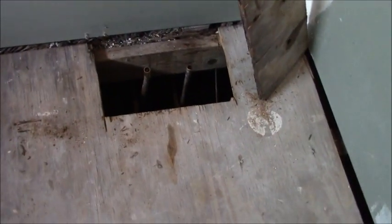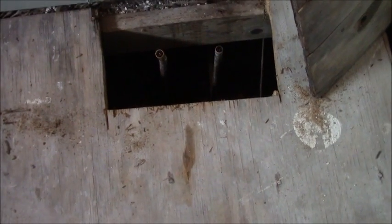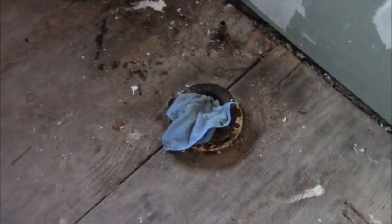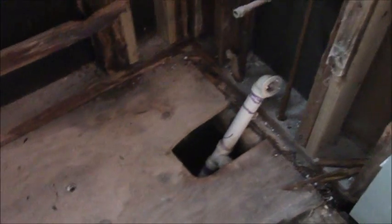This is going to get a complete makeover — a new bathroom will be here, much nicer than before. The supply line for the vanity has been cut out because the vanity won't fit unless those lines are moved back. The toilet will stay where it is, and this will become a slightly larger shower — it was originally a shower-tub combo, so this is basically a tub-to-shower conversion. This is Day 1, and the process will take about ten days even though it's a small bathroom.